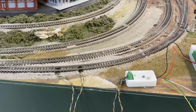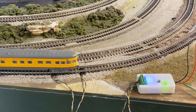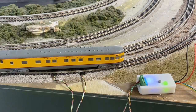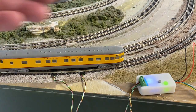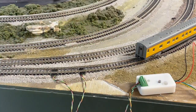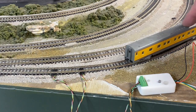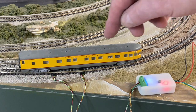I'm going to slide the train across the rails. You'll see that the blue light went on and the green light — let's say this is coming from the west. So the trigger for the westbound side would trigger maybe a signal or a switch ahead of it, and it will stay green until the train leaves that section. Coming the other way, you'll see the light turned red — that means we're coming from the eastbound side — and it'll stay occupied that way until the train leaves.